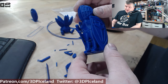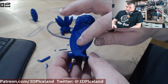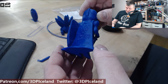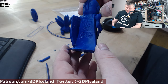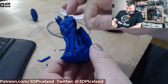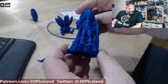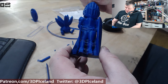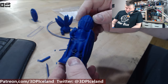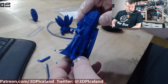Here's the zero layers model. That came out excellent except for the stringing. If I look past the stringing, the surface quality is really nice and the color is awesome — it's a really dark blue color. You can easily get rid of the strings with a heat gun. It's just a very thin web of strings, so it's not difficult to remove, but it's still a little bit of an issue with this filament.